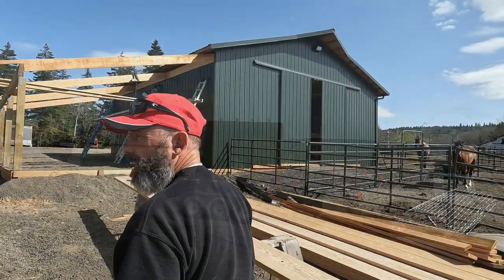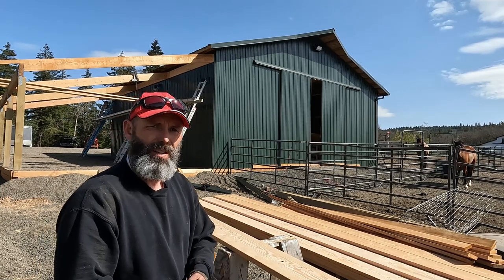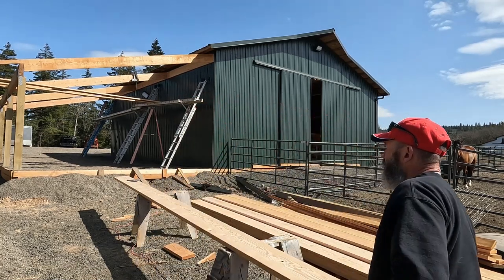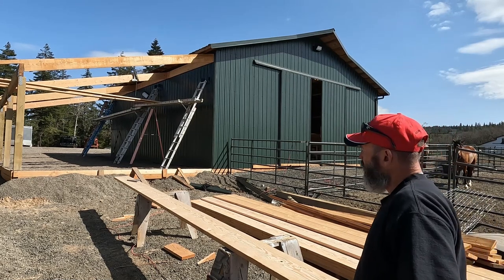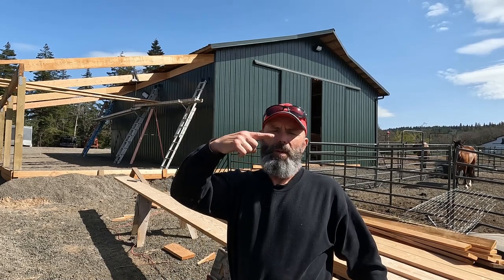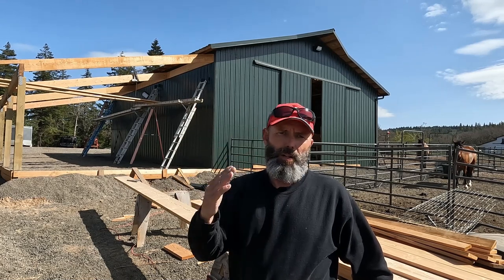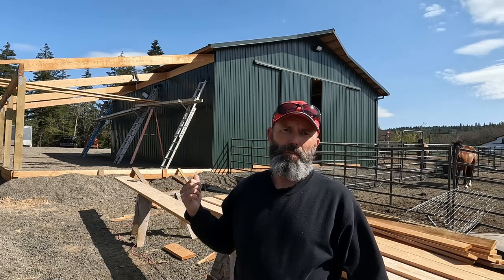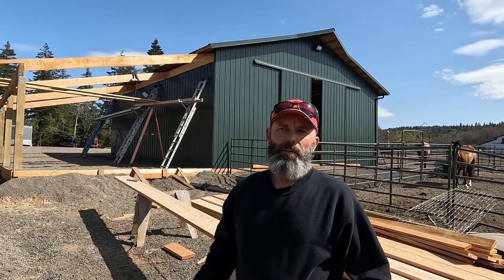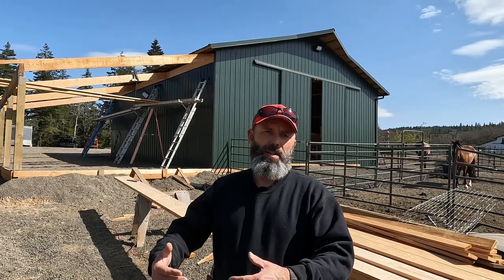I got my gravel in. Now I'm doing the rafter framing — figured I'd go over a quick tutorial on how to do that. First of all, when you lay your board out you want to find your crown. A crown is a bow in the board — almost all boards have one. You want the crown up when you put it up, so you cut it that way. When you're doing stud walls or whatever, you always want the crowns running the same way — we always go crown up so everything is consistent.